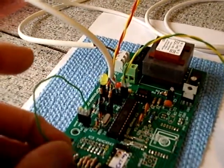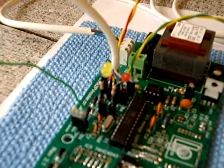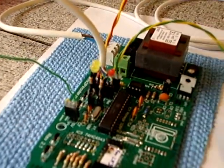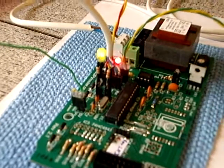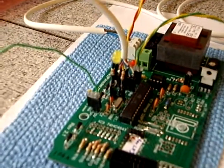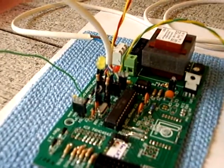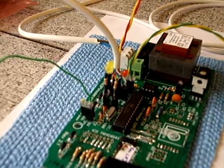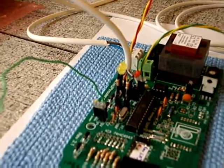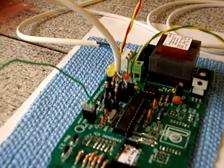What that's doing is resetting both channels, so the two channels are now synchronised and we can monitor the two to see if they're drifting. The red one on the right is CT1, for which I've got the calibration value set at 0.05, and the one on the left is CT2, and it's showing as being too slow.